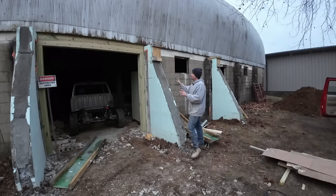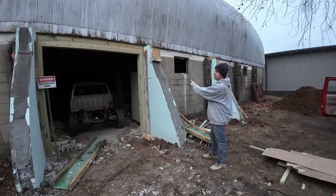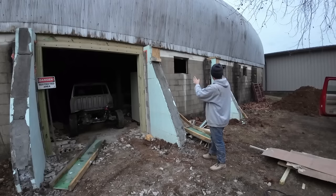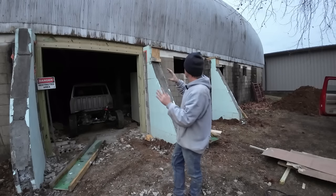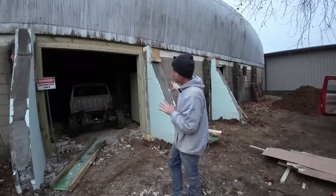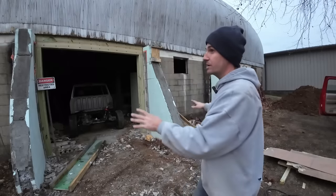The long-term plan is just what we did here, except longer. We got the building kind of split up into a half now. We'll take that half, jack it up, rip out that wall, pour a new ICF wall, a thick 8-inch with steel grid in the middle of it, ICF wall that will then tie into these buttresses, and that will replace that CMU wall, good level plumb, all that nice stuff. That's the long-term plan. We'll do both sides.